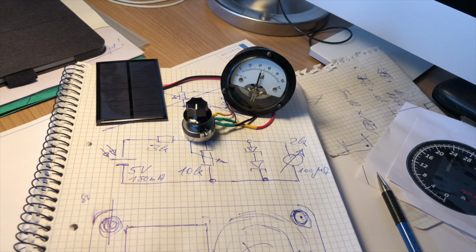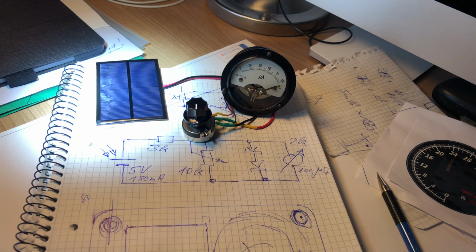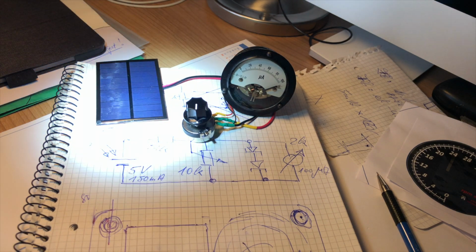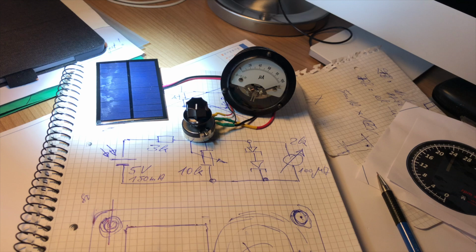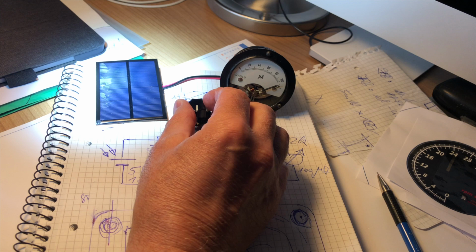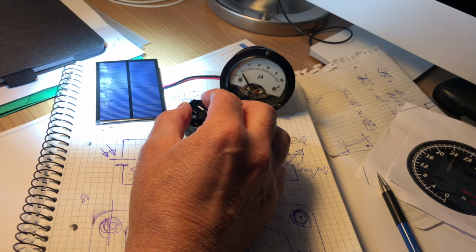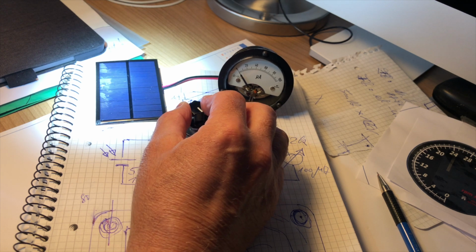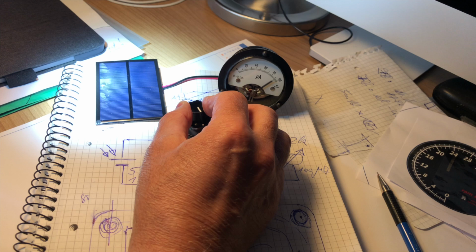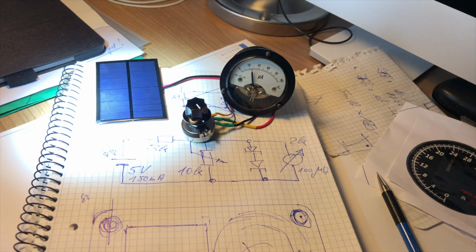I made a few more thoughts on the circuitry that I would like to share with you briefly, because it's actually very interesting. Illuminance, which is incidentally measured in lux, can vary over a very wide range. For example, on a sunny day we measure 130,000 lux outside, we measure about 500 lux in an office, and a candle in a distance of 1 meter is producing 1 lux. And this is practically the measuring range I need for my purpose. It comprises 5 orders of magnitude.